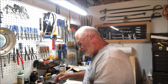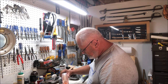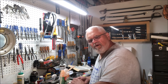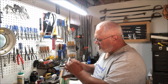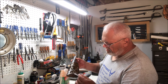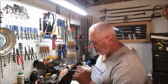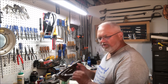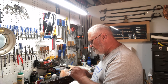I should probably read the directions. One thing about strippers is you want to put them on liberally — I like that word. I've applied it, just poured some on there, and I'm going to spread it out with an acid brush. My favorite tool in the shop seems to be the acid brush — I use it for just about everything: painting, stock finish, stripping, whatever. They're cheap, and if there's one thing I do well, I do cheap pretty good.